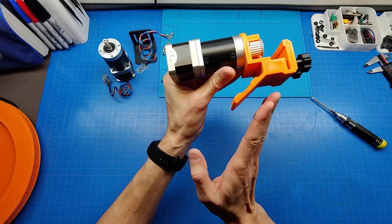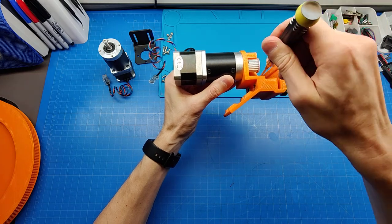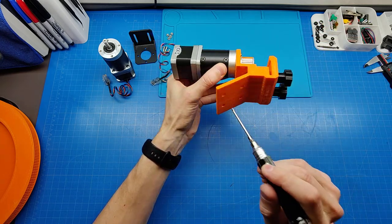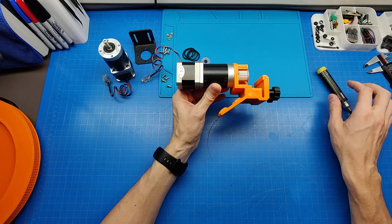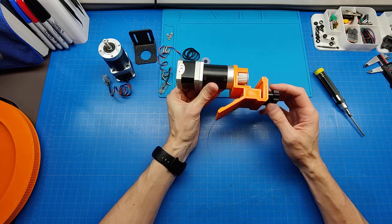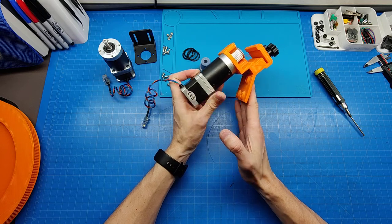So this specific angle and orientation, the distance from this corner over here. Over here we have this wall of the Dobsonian box, right? So the distance from this corner to this surface, and the orientation and angle for those drills, were very precisely measured before even printing the thing. But you can do trial and error, try multiple prints. This part is very small, it prints in a couple hours, maybe quicker if you have a better 3D printer than me. So you will see later why the dimensioning of this specific surface is so critical.